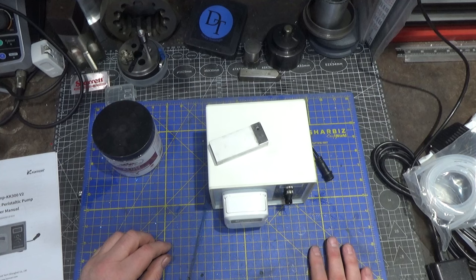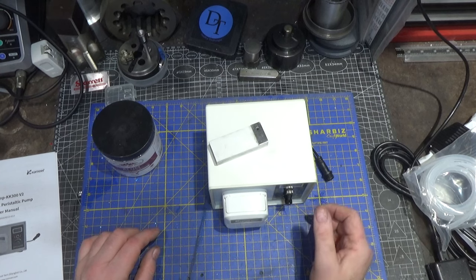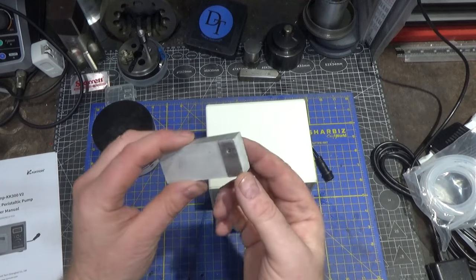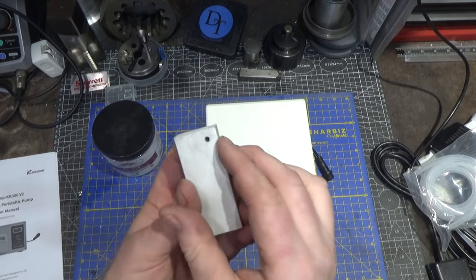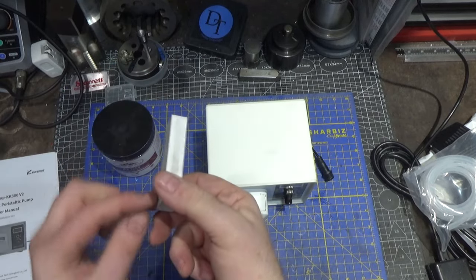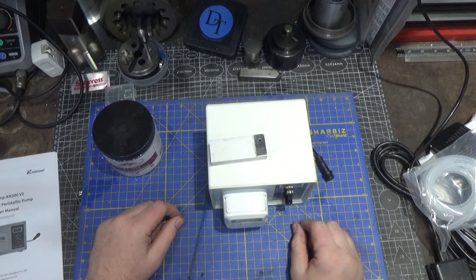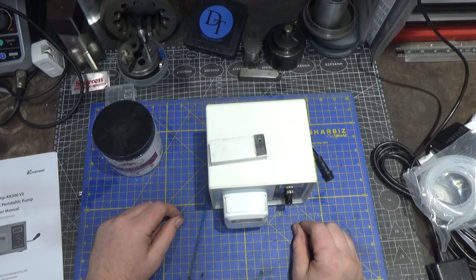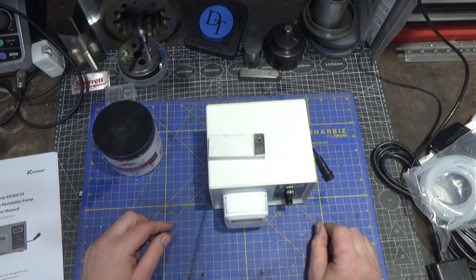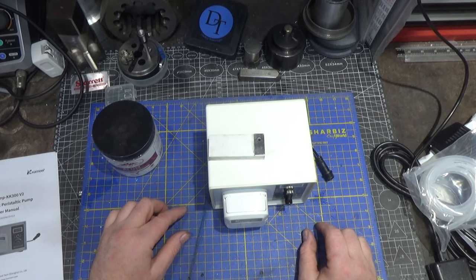So my final take: does this work? Yes, it actually works reasonably well, but it takes a lot of time. The free-floating piece didn't fully dissolve in four hours. For the tap broken off in threads with a through hole, with solution basically running in one side, it took about 18 hours — not to dissolve the whole piece, but enough to make it very loose so I could pull it out. Hope this was useful. Thanks for watching — hope to see you next time.